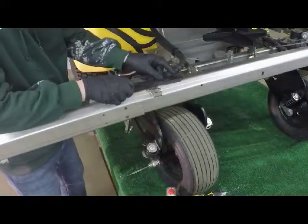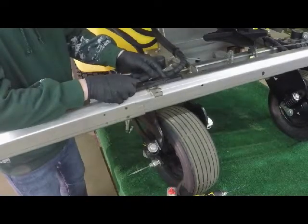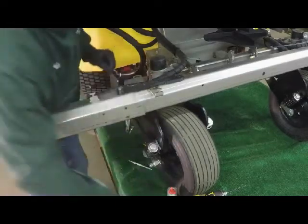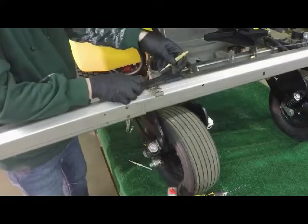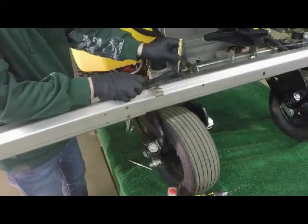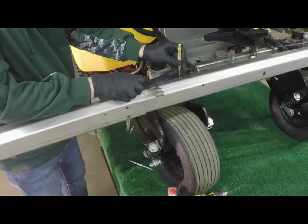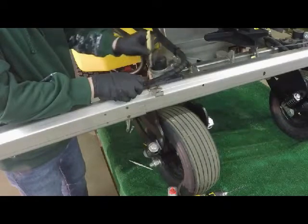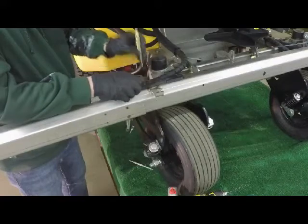Again, try to make sure that this bubble guide arm and this intersection arm section are in parallel position. We're going to go ahead and use our scribe and our center punch. We're going to mark those two holes. Everything is parallel, you can feel on the edge. Or if you need to use some sort of a tool or device to measure, you can. But again, one hole here, we'll mark it with a center punch. The second hole here, we'll mark that with a center punch.